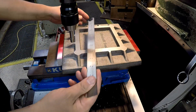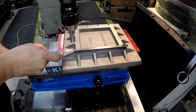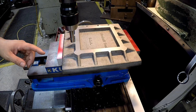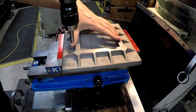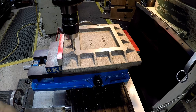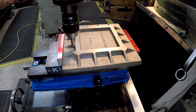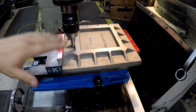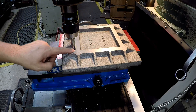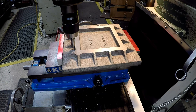Let's find center. What we have is a six-inch center on the ribs in each direction — six inches, six inches. I'm going to use the digital readout's half function to find the center based off the edge of the castings. So we're going to use an edge finder. I've got the quill down onto a stop so the edge finder goes to the same place every time since these are drafted — depending on where you hit that, you may be off a few thousandths.